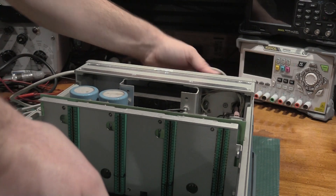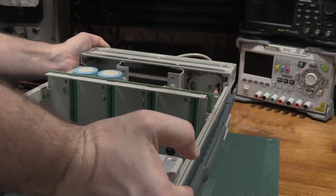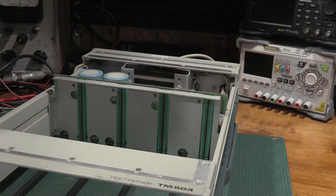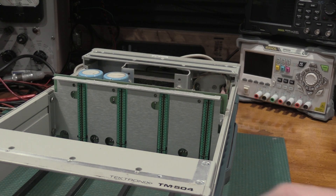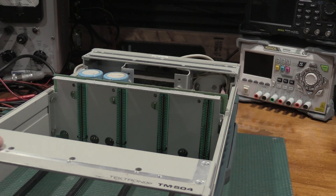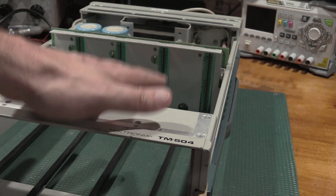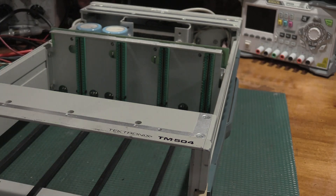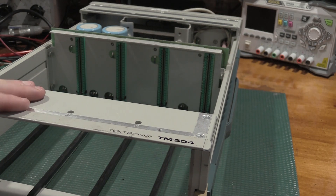Let's see what kind of passive power this thing is pulling. Turn on the power analyzer — and no smoke. Eight watts passive; probably the bulk caps are charged and good to go. Let's put the base back on because when these things sit on the bench there's no airflow on the bottom, and these are convection cooled — there's no powered cooling. So I don't want the power supply to overheat while it's doing some burn-in testing.